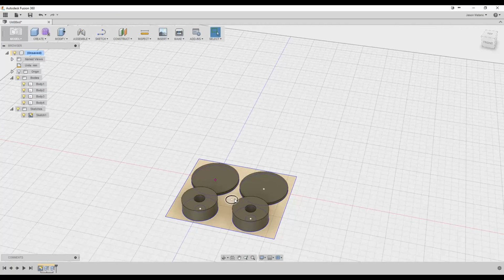The next lowest point is going to be where the drip tip holder is going to be, and I want that to be right on the surface. To get an idea for that, we would subtract from the surface, or in this case, let's just say 5 millimeters down. So we would need to know how high we're going to make this stand, and I think we're going to make this 16 millimeters.